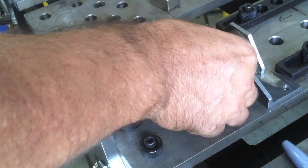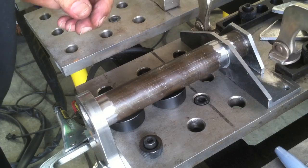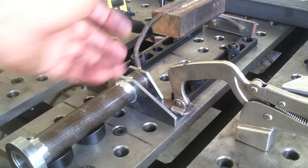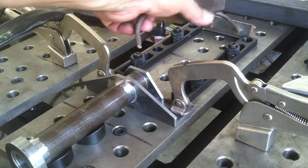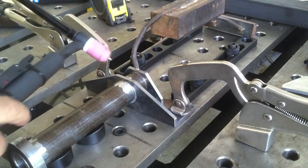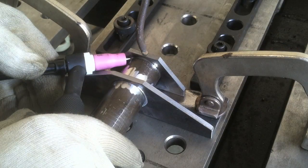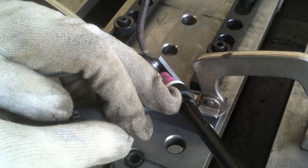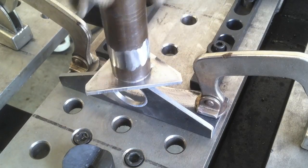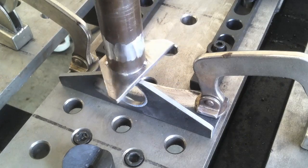That's how it goes together — once again a real simple little affair. But imagine trying to get everything indexed by hand, tapping it around with a square and a vise, using a level to get all the pieces square and parallel with one another — that would be hard. I use a third hand on part of it because I need to get my torch in there, and clamping it would make it really hard to get the TIG torch in. That little third hand tool is really handy for that. I'm just getting light TIG tacks on here to start — a real quick blast of amperage to get everything locked in place — then putting several more before welding this piece all the way around.